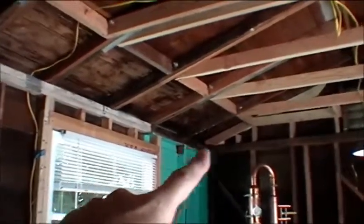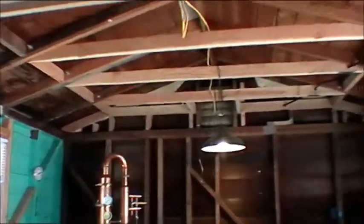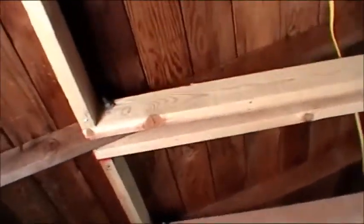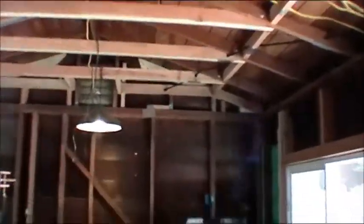You can see the ceiling. The problem I had in here originally was this ceiling was only at the height of right here, coming over this lower beam — it was an eight-foot ceiling. By vaulting it carefully, doubling it up, and using good strong half-inch to five-eighths-inch carriage bolts that you can see there, it added strength to the roof and raised the ceiling to give it a vaulted effect. Although it looks complicated, it was really a rather simple job — measure twice, cut once.